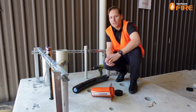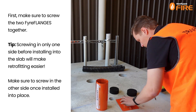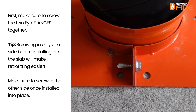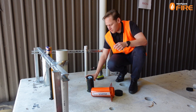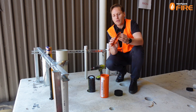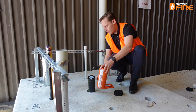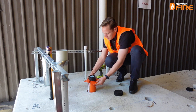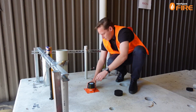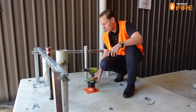I mentioned we can put these Superstoppers into a concrete floor slab, and that's what I'm going to show you now. We can also do them with beer lines or drink pipelines in walls and floors, so I'm going to use this for our demonstration. I've got the Superstopper with flanges — when installing in a floor, these only need to be on the top side, which is a great installation advantage. You still need to put some sealant in the gaps, but otherwise you can retrofit the Superstopper, slide it into place — it may be helpful to pre-fit the flanges first. Once you've done that, fit the foam and your T-wrap if required. You don't actually need any bolts to fix it into the slab; it's going to hold itself there in place.